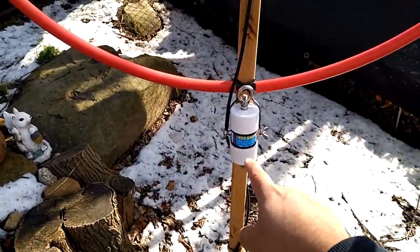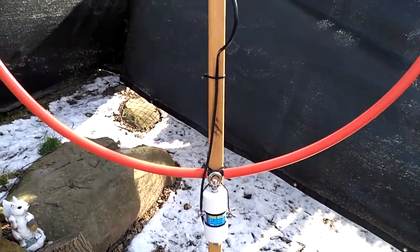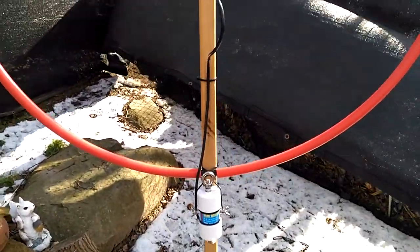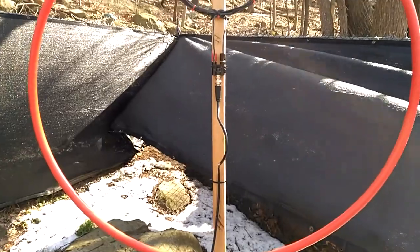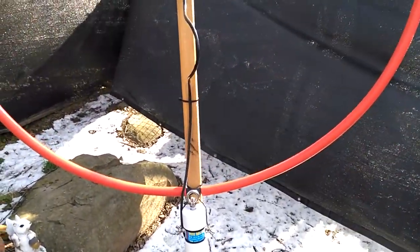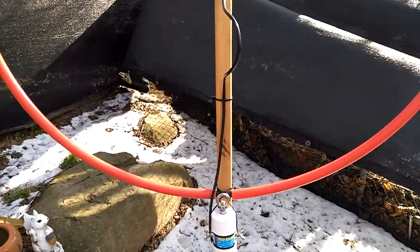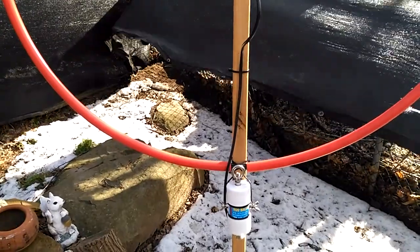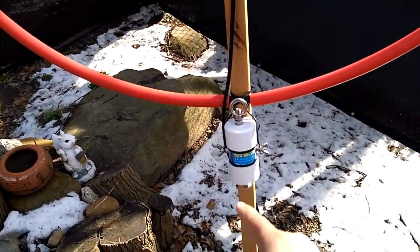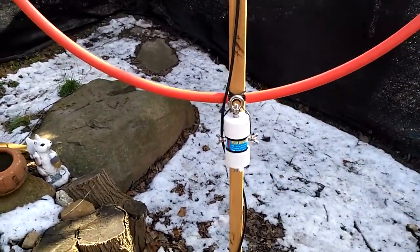If you watch the video, I made it clear that I wanted this to be more of a broadband antenna. I didn't want it to be specific to long wave or medium wave — I wanted it to be a little broader than that. That's why I didn't put in a variable capacitor, even though I did buy one. Since this is going on the roof, a variable capacitor defeats the purpose.